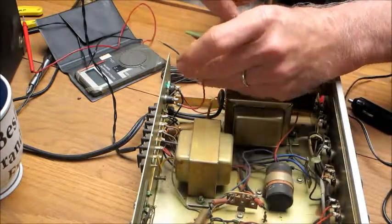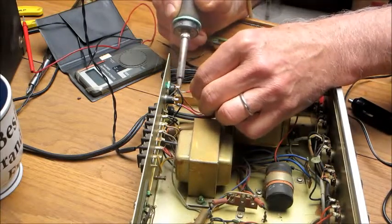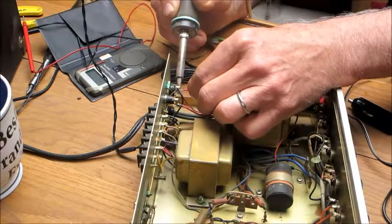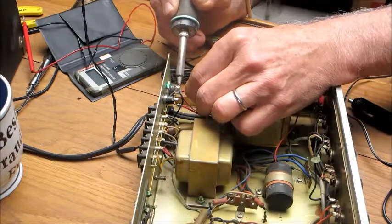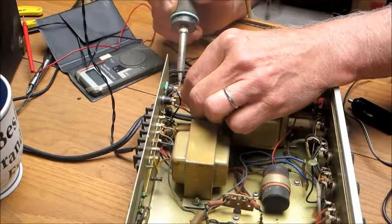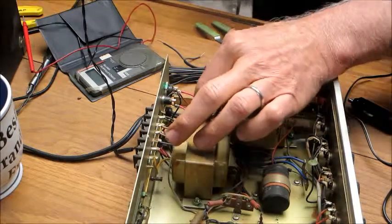Okay, I've already got this end tinned. Get a little bit more fresh solder. Now, the reason I'm putting solder on the tip is to give it better contact with what I'm soldering. I'm just using the solder blob to heat the contact area. I'm not blobbing it together with the hot solder. You want to heat your material up, not use the solder as the joint. It's getting pretty ugly, but I think it'll work. Yeah, she's on there. All right.